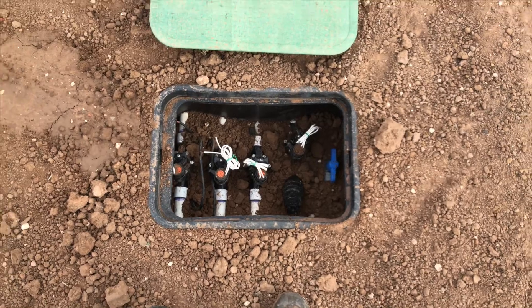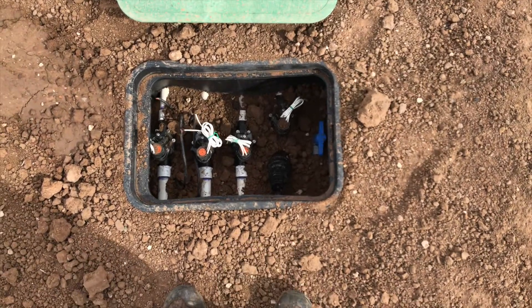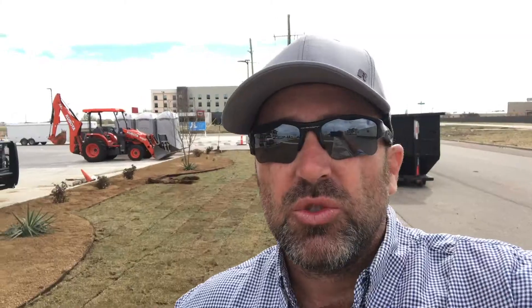It just makes sense. And you can see in this picture right here, it also makes it look a lot cleaner — you keep your pipes straight. When you do them in order, I know no one ever sees this, but it actually looks good. No pipes are crammed over one another; they're just in line, they're straight. It's kind of taking your installation to the next level. Think about how you're installing these valves — put them in order of the way the zones are split out. So when you're installing the valves for your irrigation system, think about how the zones are laid out, and if you're going to manifold them, put them in order. That way when you go open that valve box and turn one on, it makes sense.